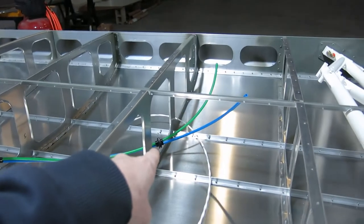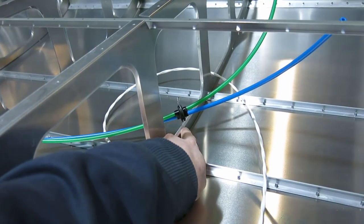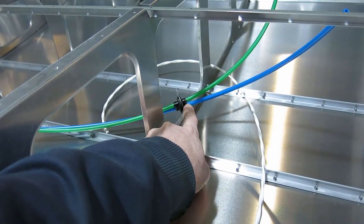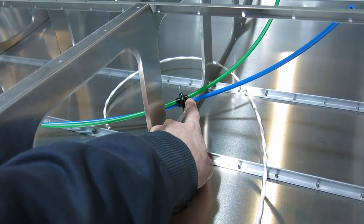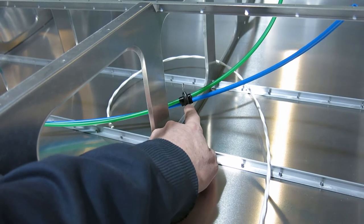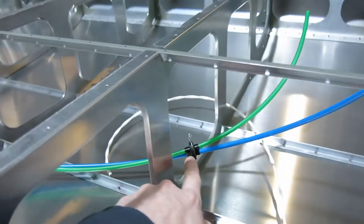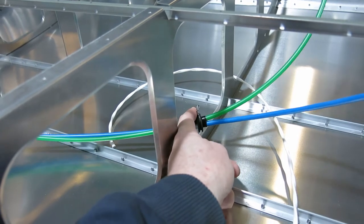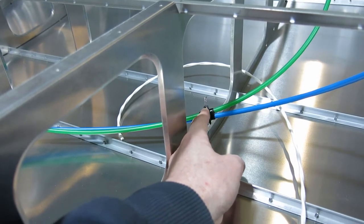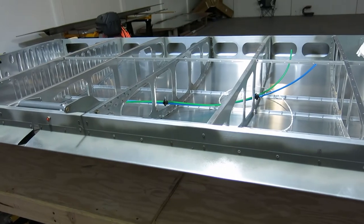Redo the grommets. We got the grommets on for the pitot tubes here. In the original plans for the RANs, they have you just do a safety wire loop here, do a couple of turns, and then tie in the pitot tube. I didn't like that wire directly against those tubes and against that tape, so we put a grommet in there and ran the wire around it in the channel of the grommet. Well, I think it's too small, so when we wired it, it squashes out, and we noticed it's already cracking. The rubber's already cracked on the top and on the bottom, so we're going to replace those and keep them round. That just prevents chafing in there, so we're going to get those replaced. And anything else you can think of off the top of your head?